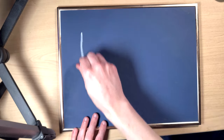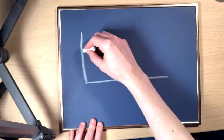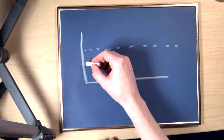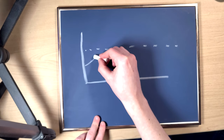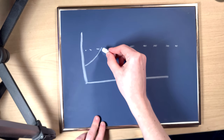Hysteresis just means the tendency for a response to lag behind inputs. And in this case, it's something we're going to implement intentionally. So imagine that you have a target temperature of the room. Initially, when it's too cold, the heater is going to come on and the temperature is going to rise, and then you're going to pass the temperature that you're targeting.